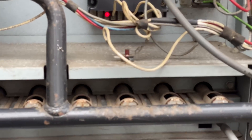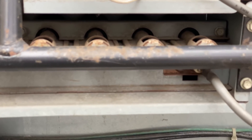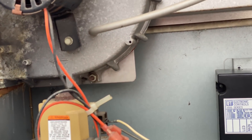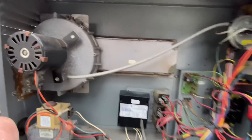We're on. Here we go — we got a solid light on. All right, steady on is good, control is okay. I connected everything back up. So now we're just waiting the 30 seconds and it'll fire right up. There we go — sparking and we're on. All right. I'm going to have to clean the flame sensor. This guy doesn't sound that great either — hopefully that goes away. I didn't hear that earlier. Give it a few seconds to run, see what the amps are.